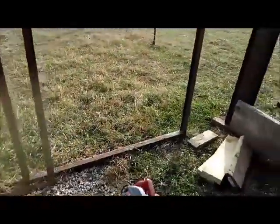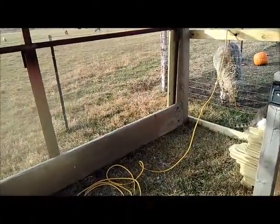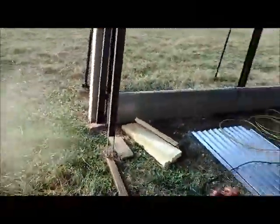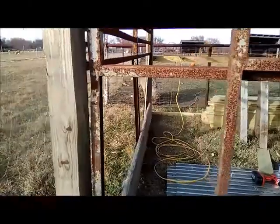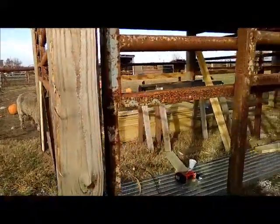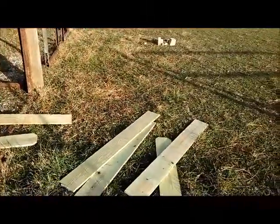I'm gonna start with the door because it's perfectly square, and we're putting new bottom braces across the bottoms. I work by myself, so the doors are square and that's what I'm starting with — two perfectly square spots. From there we're going to frame these out in wood and put our planks in between, so it'll have a top rail and a bottom rail on the inside, then planked in between. Those fence planks, by the way, cost a dollar sixty-eight.